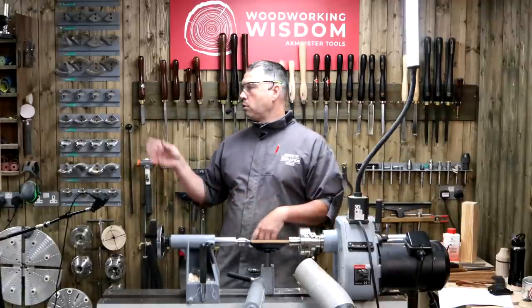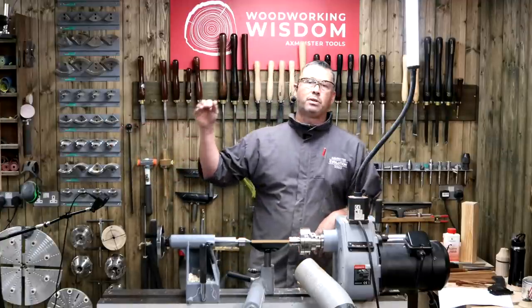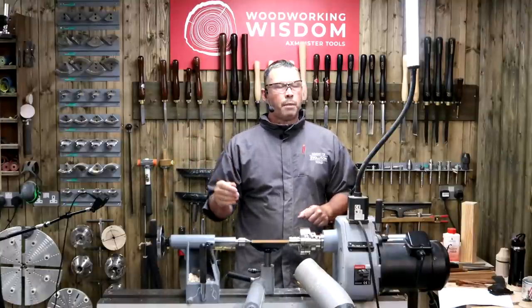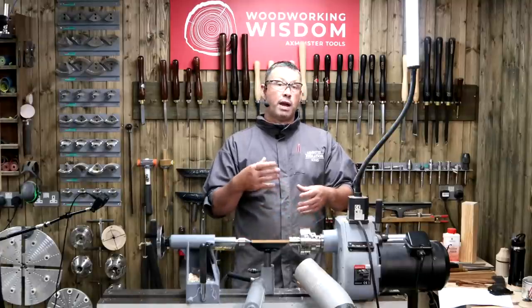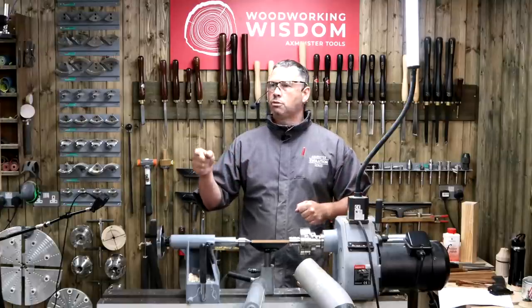Go for an extractor that creates air speed and volume — the impeller type, ones with bags or a cyclone extractor, which create fast airflow. Unlike vacuums, something with fast air speed will pull from a distance. A vacuum is great at source but dissipates quickly as you move away. I'm using the AC 118 CE but the 60 CE works too. Steer away from vacuum extractors — the bigger the extractor, the more airflow and holding capacity you'll get.